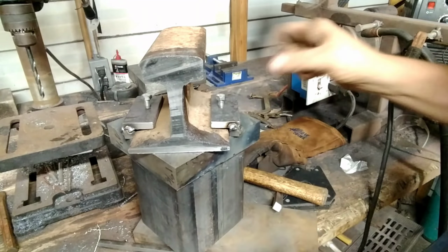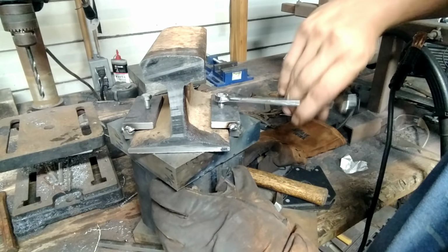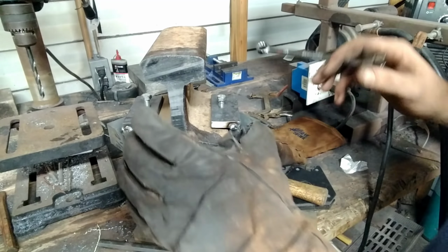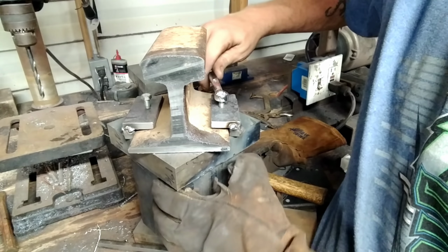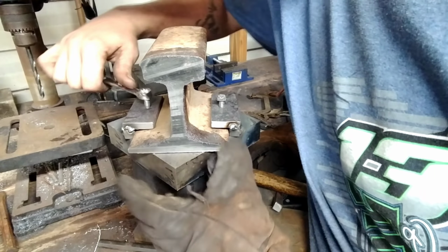They don't have to all be railroad track dies. Can make them out of anything as long as it's got a 1/2 inch thick plate for the base of the die to slide in to lock into this. Then I can weld tool steel, different shapes, fullers, whatever. You know, but I had railroad track laying around.